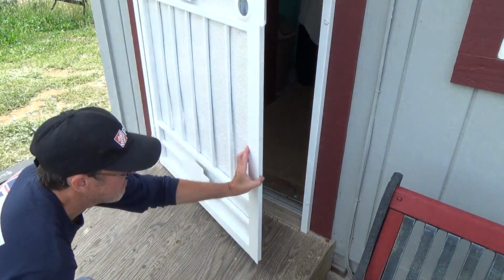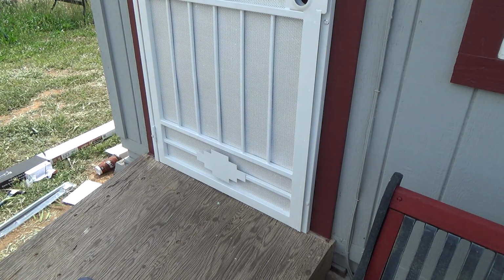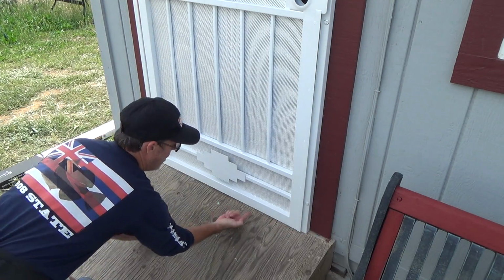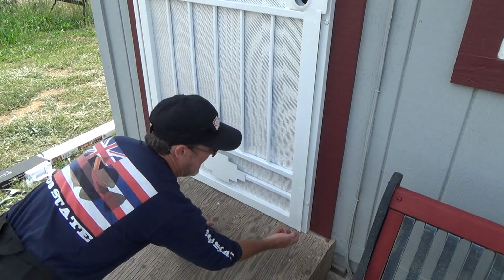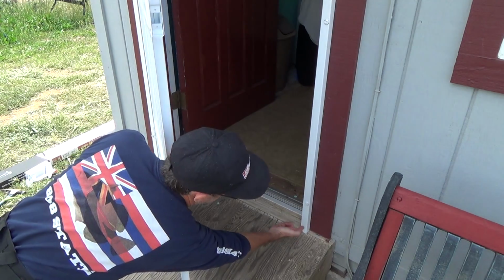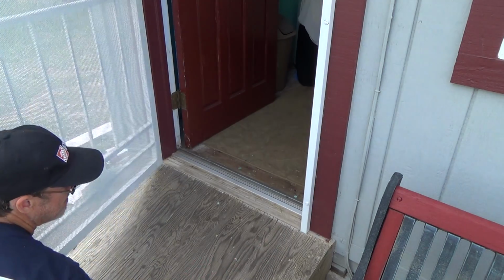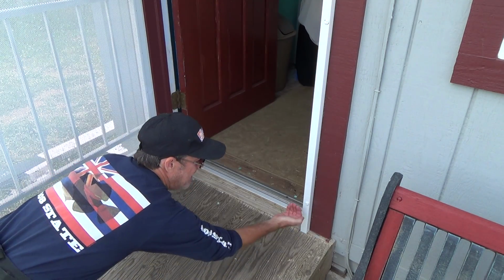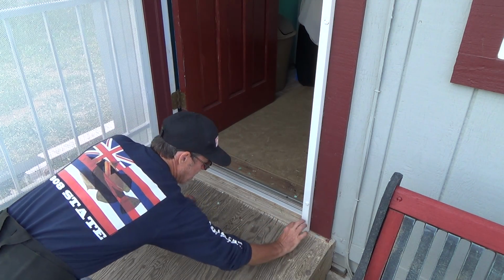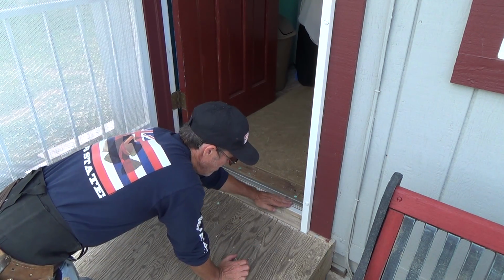Well, at the store they have a weather stripping kit, and it's U-shaped, made out of tubing, and there's a piece that comes up this way and then all the way along the bottom and then up this way. And then what you would do, see, this square tube here is hollow on the back side. So if you didn't have anything here, you could take that U-shaped thing and kind of fish it in and then lift it up and put it right up in here, and then you screw that in. Okay, then it's got a square tube that goes here, and then you would raise or lower this so it's about flush with your threshold.